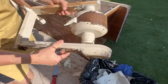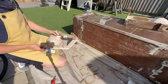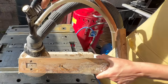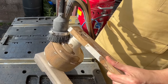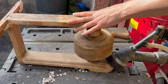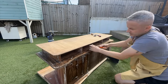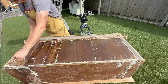Not as much on the legs unfortunately. The legs were also quite badly damaged and I had to repair and reglue them. I thought the best and easiest way to remove the paint on the curved surfaces was to use my sandblaster. When I was done sandblasting I did some more scraping and then a little more.